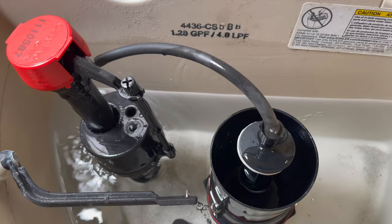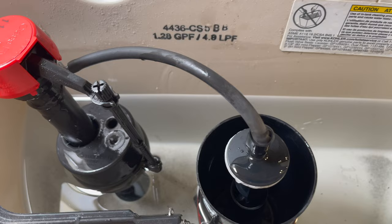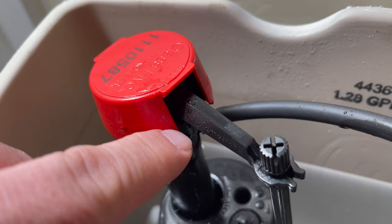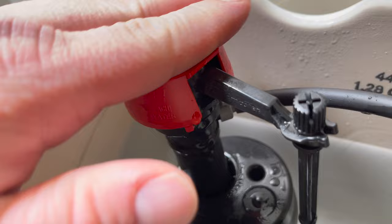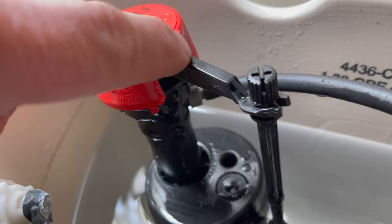This is a canister flush. This hose here is a little on the short side — it keeps wanting to pop out when the canister comes up. That's going to be one of my reasons for doing this entire replacement on this silent fill valve. As the water comes up, I've got a little leak right up in here. Once it's filled up I'll show you what I'm talking about. This is a Kohler Class 5 — you can see I've got water just spitting up inside.